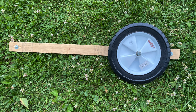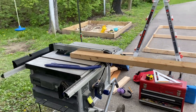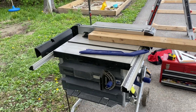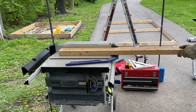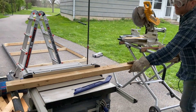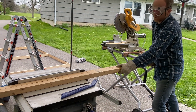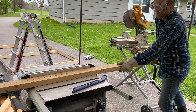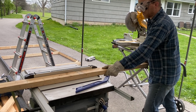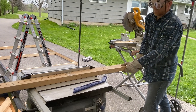And that's it. You need two — one for each side of your coop. For this board there was no specific measurement; it's maybe somewhere between two and three feet long and we just cut a two-by-four in half. It just needs to be thin enough to work with but not so thin that it's flimsy, and long enough so that you can get a good amount of leverage without being ridiculously long.